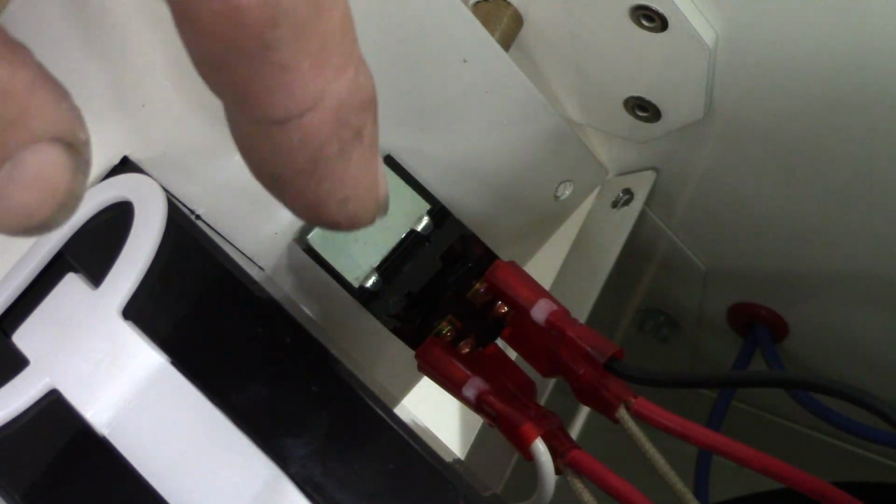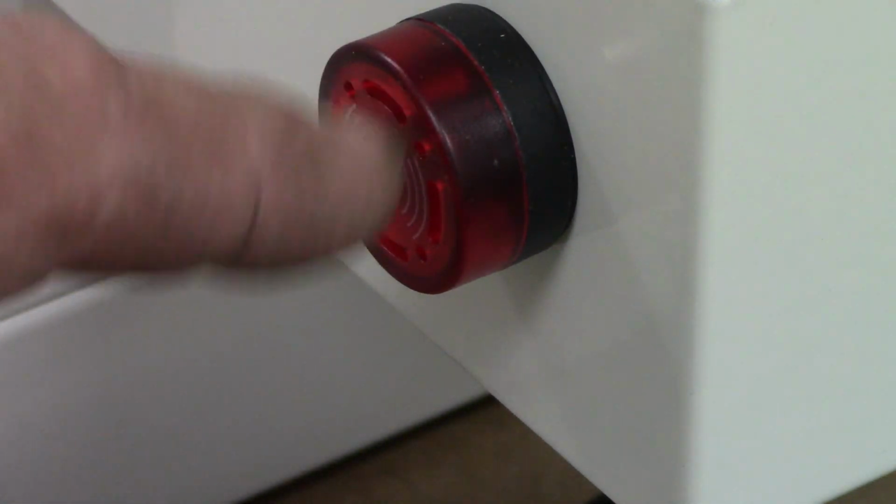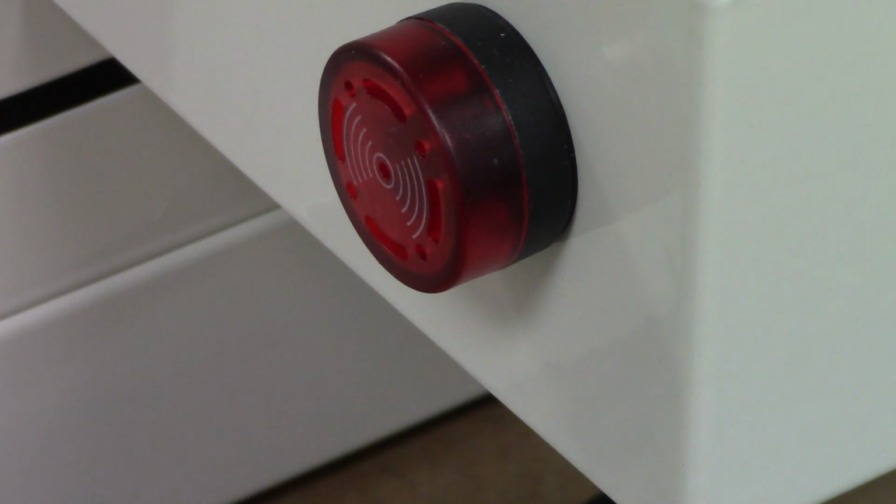So that's another modification that gets done to the high voltage units. The other thing that gets added is a 250 volt rated switch, but it's a 2-pole switch. So when we pull away the control power, we're pulling away both legs from the controller and the rest of the system. So we do switch both legs with a different switch. On the 120 volt, it's only a single pole. And last but not least is the actual alarm. That's a 240 volt alarm, and it'll run all the way down to 200 volts. So anywhere in between, it's going to be perfectly happy in that voltage range. So your alarm is rated for line voltage. And we did all this to this oven with no transformers or external power supplies. Everything is a purpose-built component that goes into the oven that makes it 240 volt.